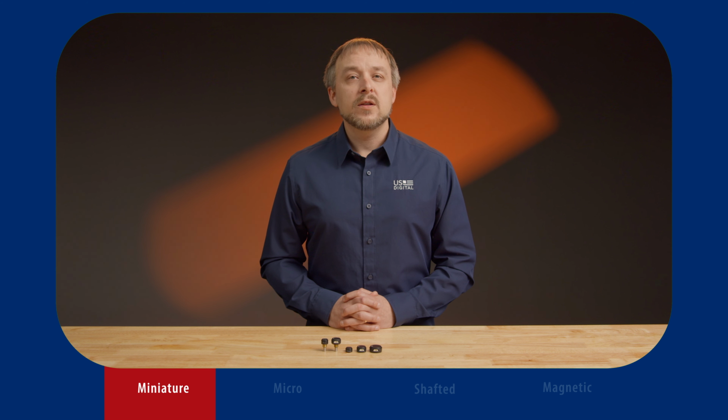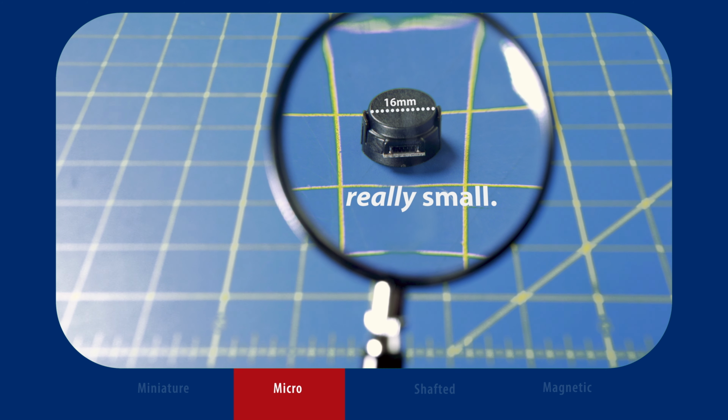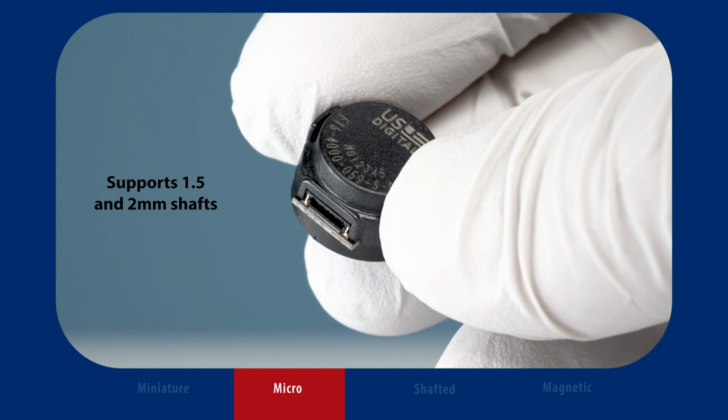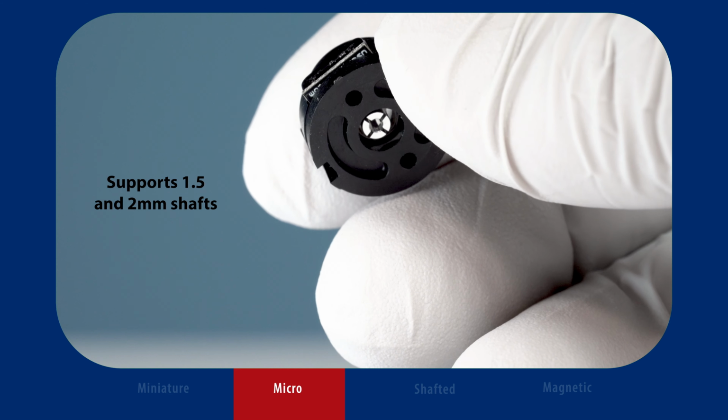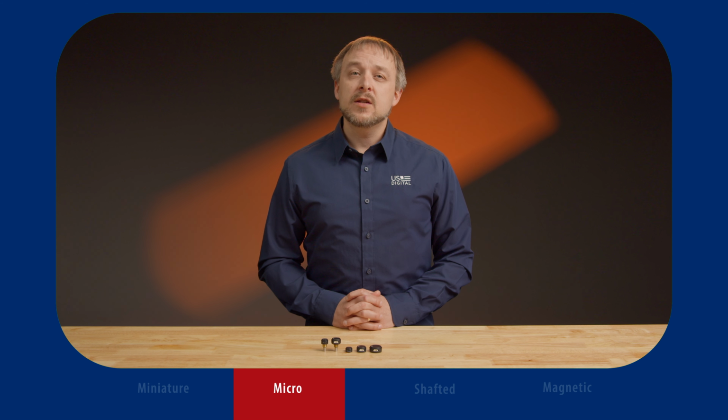If you're looking for one, you can go a little bit larger with our E5 or E2 encoders, or you can save even more space with our E16 micro encoder. The E16 is only 16 millimeters in diameter and supports 1.5 and 2 millimeter shafts. This is a great option if your design requires a motor and encoder to fit into a small enclosed space, or if you have limited mounting space on a micro motor.